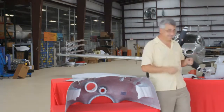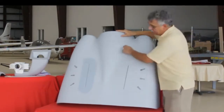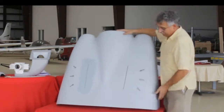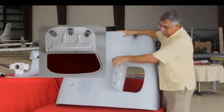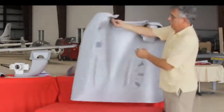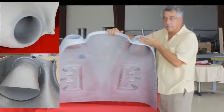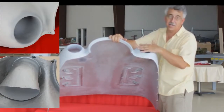Now let's go talk about the upper cowling. This is the upper cowling — again, carbon fiber and fiberglass construction. One of the long-running problems with Mooneys is cracking along the top cowling. We've eliminated that. As part of the lamination process, we put three extra plies of woven carbon fiber in this area — really, really stiff. Access on our cowling is much better than the stock cowling. We have three latches on both sides, a pretty beefy door — you can reach inside and check the whole top of the cowling much better. The inlet is a much better inlet: round inlet, nice diffuser duct. You'll notice that the split line on the top and bottom of the cowling is below the inlet. The shape of this lip is very, very important, and by keeping the split line away from the inlet, we ensure that it stays in good integrity and good shape.